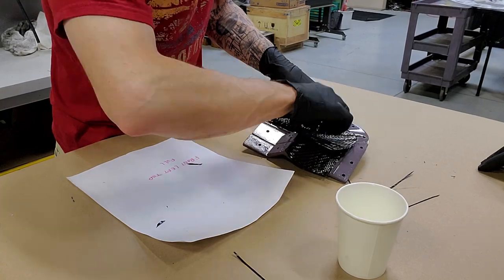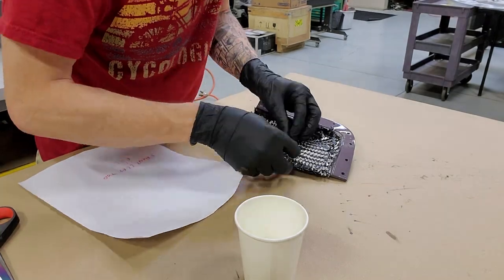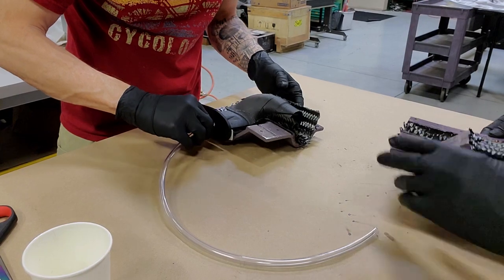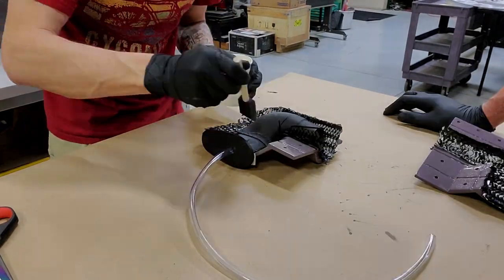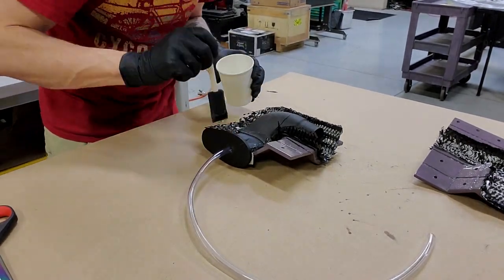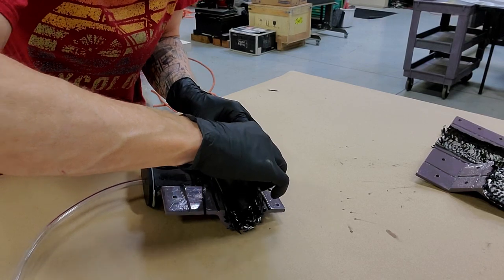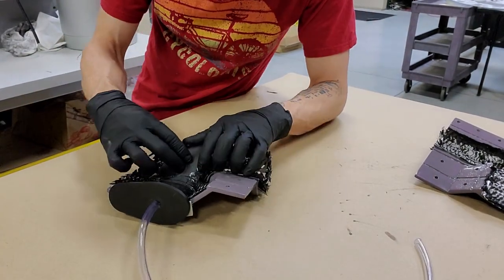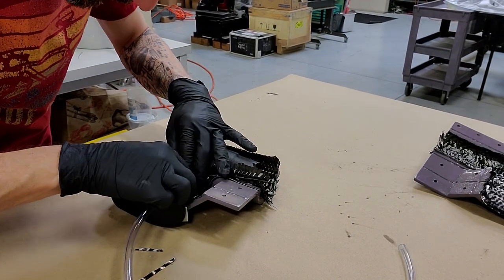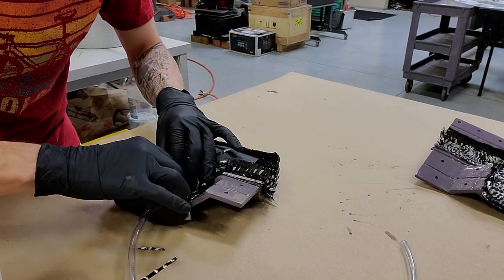And repeat pretty much the same layup process for the top half of the mold. And then the core goes in just like with the other parts. And now we do the lap using the epoxy to try to stick. And this 12K material here is pretty stiff and just really doesn't like to fold around, especially tight corners. So this was pretty messy and kind of crappy, but it ended up working out, but we have a much better solution you'll see coming up.